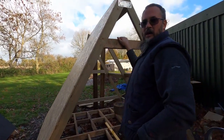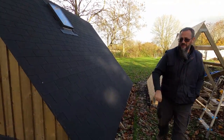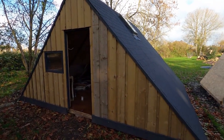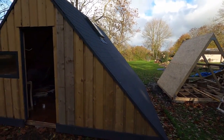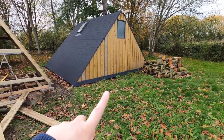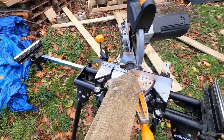We're going to get the other two boards on and do the cladding at the back. We had quite a few comments on our A-frame cabin — which is a home office, not a dog house — that it looked like a nice house for a dog, and someone said nice for two-legged dogs. For the cladding on the back, we're replicating the 6x1 castle boarding we did on the A-frame, but leaving air gaps rather than overlapping, just to let the air circulate through so the logs don't rot out.